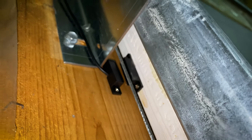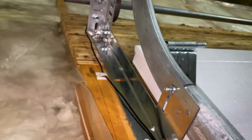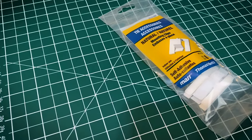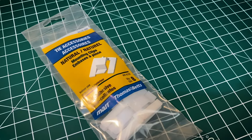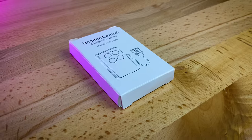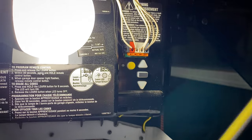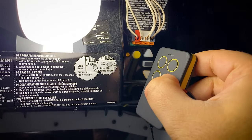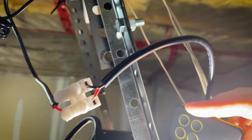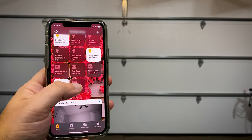Here's the unit attached — I used those zip ties and some 3M tape to get it to stick in place. It's plugged into the ceiling. Take the sensor cord and plug the two wires into the two ports that you tripped earlier with the test wire. For the sensors, I put them along the side — one screwed into the door and one screwed into the side of the frame. I used some inexpensive white clips to hold the sensor wires in place. Some garage door openers may need an additional accessory, which Meross will send you if your opener has a yellow or purple learn button. Instead of plugging the sensor wires into the ports, you plug them into this accessory device — super simple.